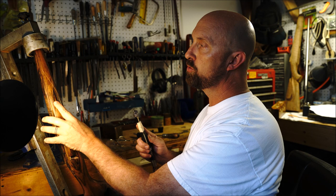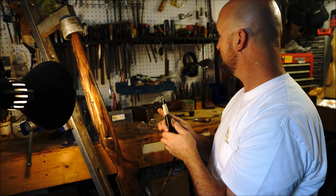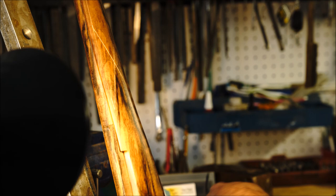I've already set up this tool to cut 22 lines to the inch and we've got a basic checkering job here. It's just the two points on each end of the pattern. The two points on this end are established with our master lines and the other two points will be established at the end as we build across. I've already cut the lines to depth — we used a 5/8 inch number one cutter, cut our master lines in, and we're ready to begin checkering.